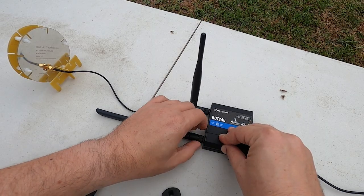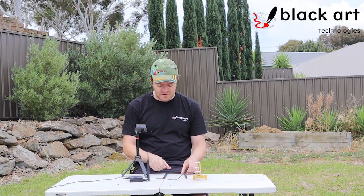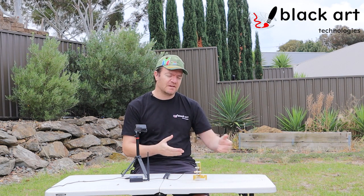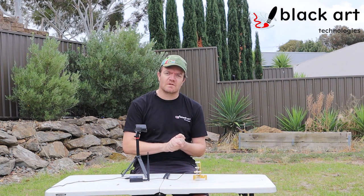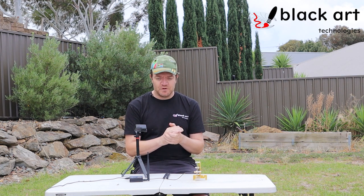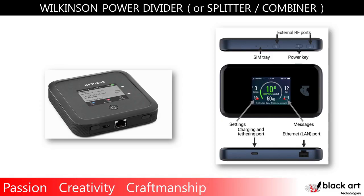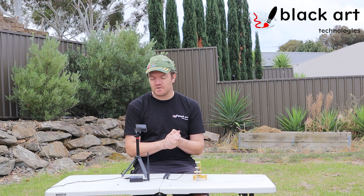The other thing coming up now is 5G. Proper 5G antennas would be four-by-four, so they might have four antenna ports. The higher-end modems — this is 2021, so things may change — that cost a thousand to three thousand dollars have four antenna ports. So the rule is one antenna per receiver: four ports into a 5G receiver. However, consumer-based 5G modems like the Nighthawk M5 or the ZTE modem sold as a Telstra Wi-Fi modem only have two ports.